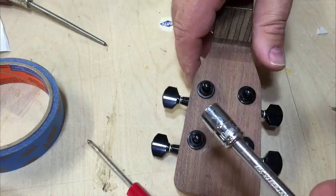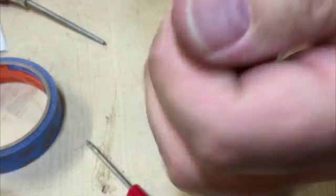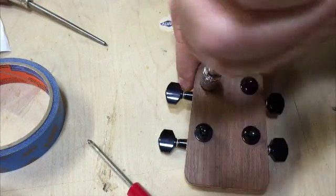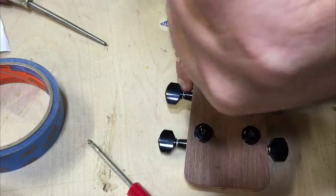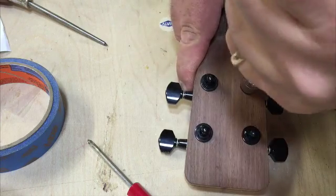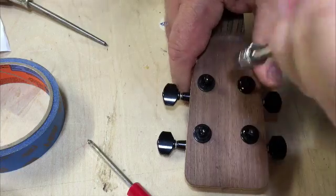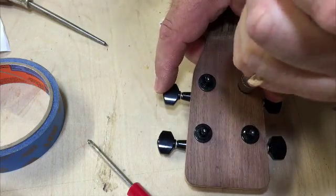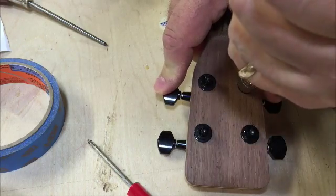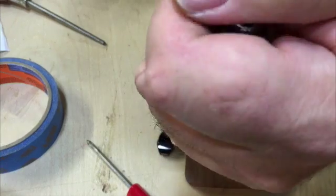And now that the wood screws are all tightened up, I'll tighten up the bushings. The bushings need to be snug. Just be careful not to over tighten because they are very fine threaded material and it would be easy to strip them out. The socket slipped off the bushing a couple times. Just be careful when you do this that you don't mar up the surface of the bushing or the flat washer. You don't want the appearance of it to be scratched up.